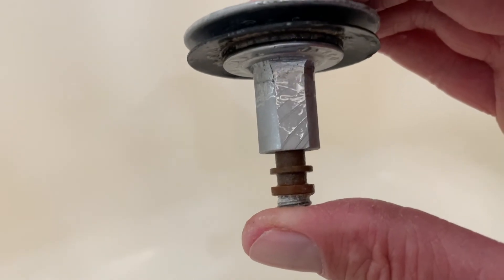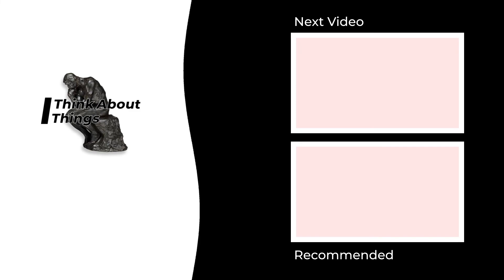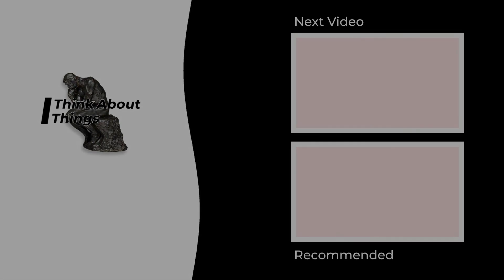What we are going to use instead of chemicals is the drain router. You can pick these up at the dollar store, online, Walmart, Lowe's, Home Depot. You don't have to take the plug off as long as it comes up where you have room. This is very thin, made of plastic — you can see it's got barbs on the side. Be careful with those. We're going to feed that down into the drain as far as we can.